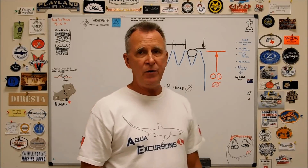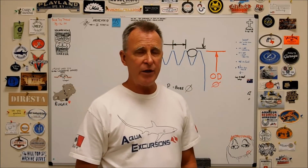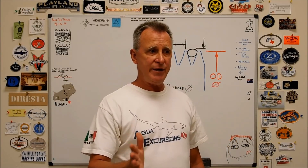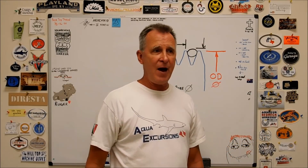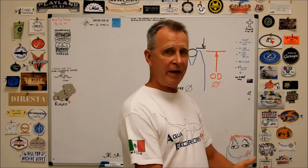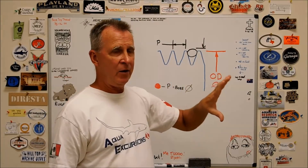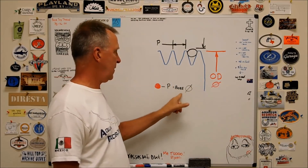Determine the pitch value however you need to. The way I do it, if I don't already know the part by having a print, you can use a pitch gauge like this one. Be careful if you evaluate a physical thread with a gauge and you don't have a long stretch of engagement to check — because some metric and imperial threads overlap close enough that the mating part will go on partway but then hang up. That's because it's metric or imperial and the mating part is not compatible. OD of the part minus the distance between pitches equals the bore diameter.